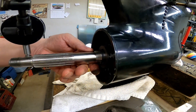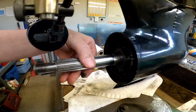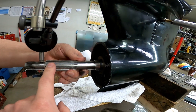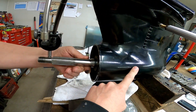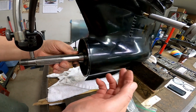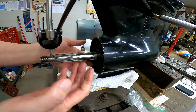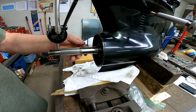The issue talked about with straightening these prop shafts is in here where the two prop shaft seals sit in the carrier. This outer part is stainless, and it's friction-welded to another piece of shaft that's got all the machining done on it for the gears and bearings — which is a different material. So it's made out of two different materials: stainless on the outside for corrosion resistance, then past the seals where it's protected and in oil, a different material. They wouldn't make the entire prop shaft out of stainless because of hardness requirements for the bearing surfaces, gear contact areas, and where the gears are running. So if you put a lot of strain on the thing straightening it, you could compromise that friction-weld.